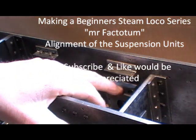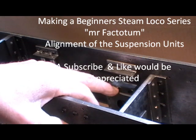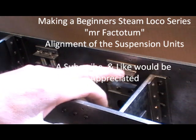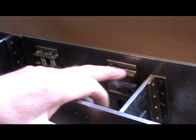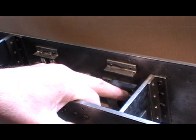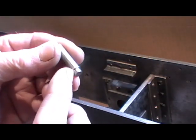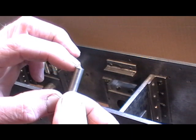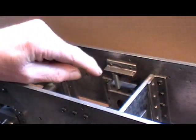Just a little tip here — I'm about to fit the suspension on my loco. To get the spring retainers in the correct position with the holes in your suspension brackets, I haven't drilled my holes to the dimensions in the book. I've left those blank. I've got my holes drilled ready in the axle boxes, and I've made this little transfer tool that sits in the axle box — the correct diameter and length — so I can mark it with a point.